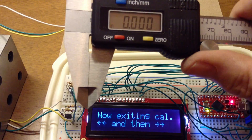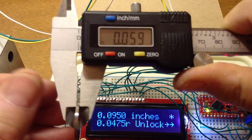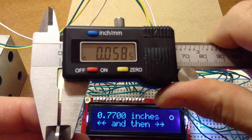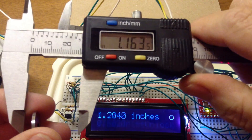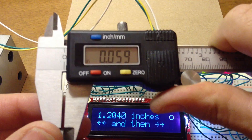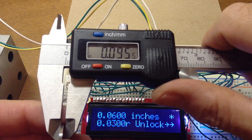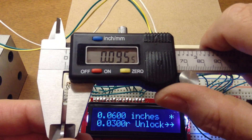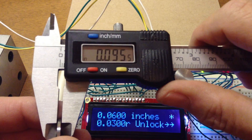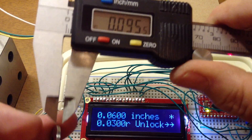Just to start at the bottom of the range of calibration — there's my 60 thou. I measured my 60 thou, and instead of getting 58, I can see that I'm getting 60 thou. The star means that it came through the calibration software.